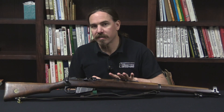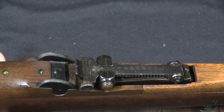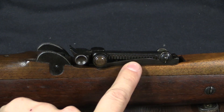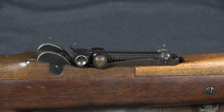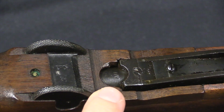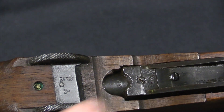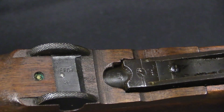Let me show you up close. Basically, the conversion to Mark 7 high-velocity ammunition involved grinding down the sight base so that it had a flatter curve, which matched the flatter trajectory of the new projectile. You can identify that by eye if you really know what you're looking for, but to make it simpler they went ahead and stamped an HV for high velocity on the barrel just behind the rear sight, so you can lift up the rear sight and check that on any rifle.